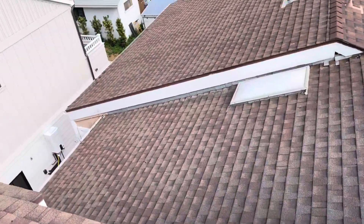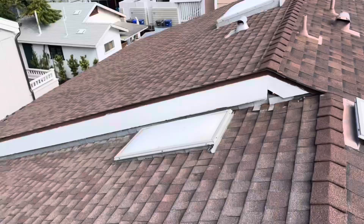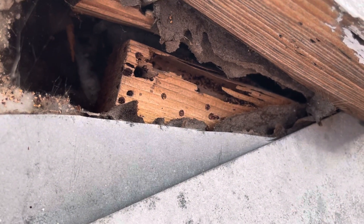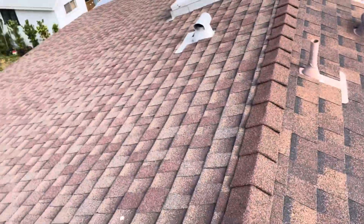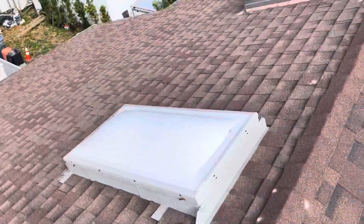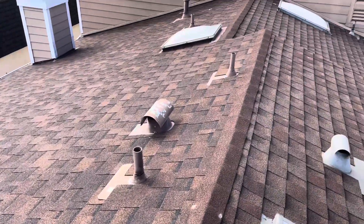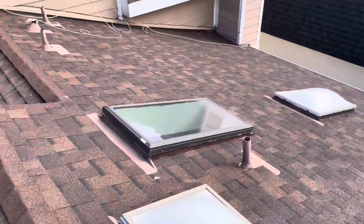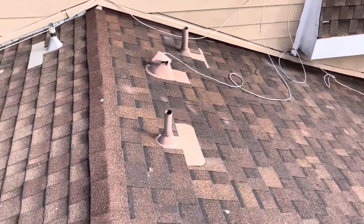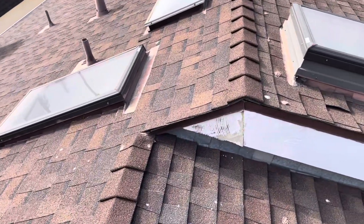Our assessment of this roof: there are multiple compromised areas and multiple leak points. You can see more of that termite damage — just how rotted away this wood underneath here is. Because of this substantial termite damage within the wood, we don't know exactly how much wood is going to need to be replaced, but we know a good amount will be rotted out. There are multiple leak points, so we would definitely recommend just re-roofing this because of the amount of compromised areas. We do know that water has been actively getting into this roof, so I'll get this out to the owner and go over some options.